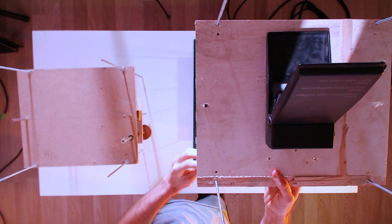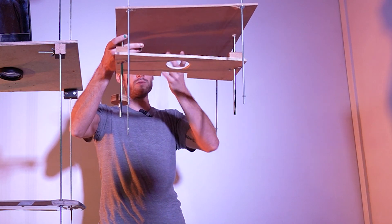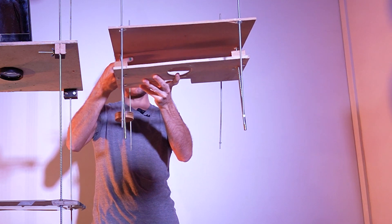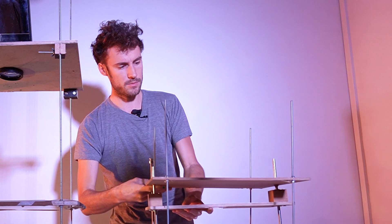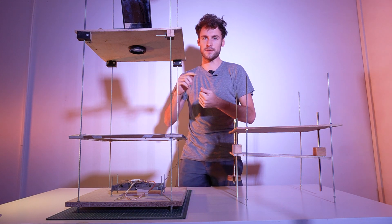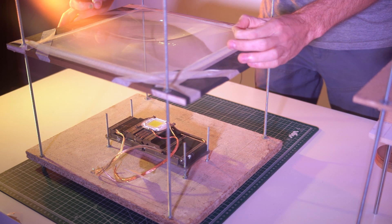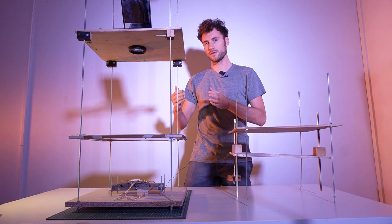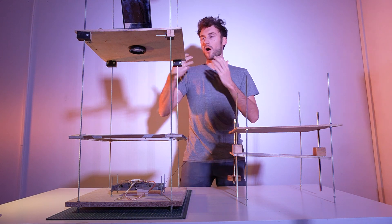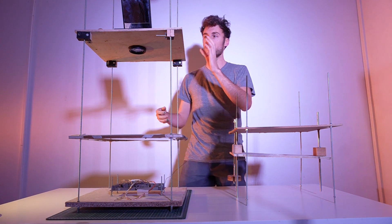I have to adjust with tiny pieces of wood — I can unscrew and screw again, so it's not perfect yet. I'm working on a prototype of a focusing system with 3D printed and CNC parts. After, it would be possible to do my own focus system from scratch with the functionalities I need. For example, I can add tiny motors and switches to motorize the system, or add buttons on the side for left-handed or right-handed use. It would be personalizable — things not possible on existing overhead projectors, where the focusing system is always on the left.